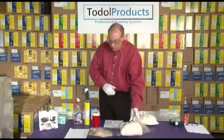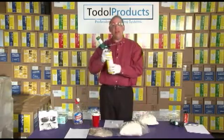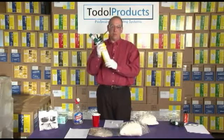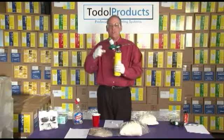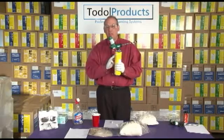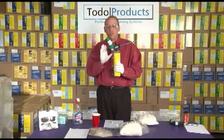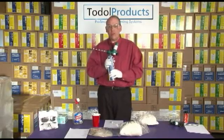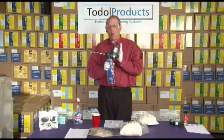So that's why it needs moisture. When you foam, shake the can — that mixes up the resins and the propellants. Those are the three key components: can temperature, provide it with moisture, and shake the can. Then in storage and when you're not using it, always leave a can on the gun. No moisture can get into the system and now you're always ready to go.